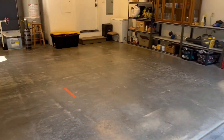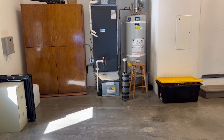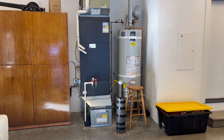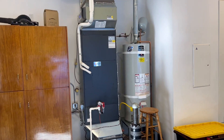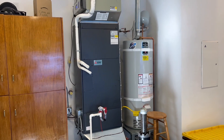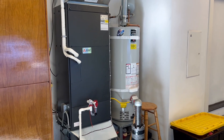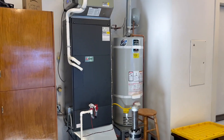This house had roughly 50,000 BTUs of heat loss at 15 degrees, and this system is going to keep us heated well below that 15-degree mark. We have zero backup heat on this — no strip heat kit, nothing. We have full confidence in the Hyper-Heat system here.